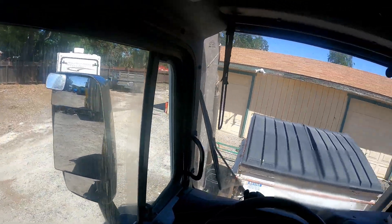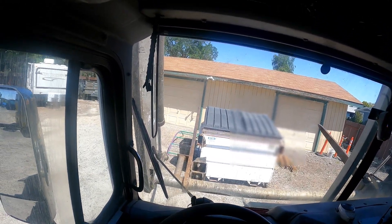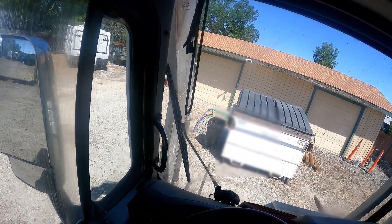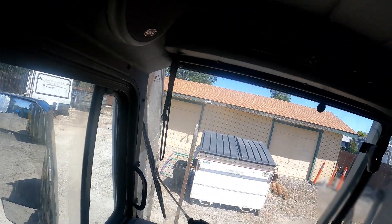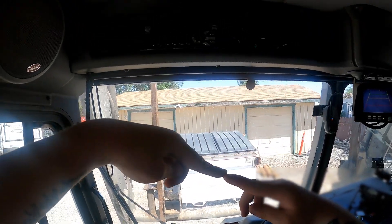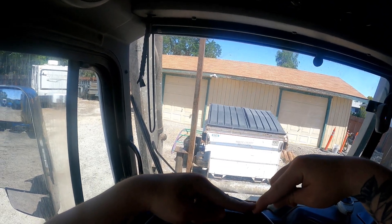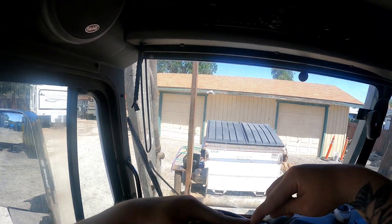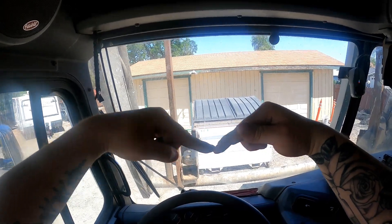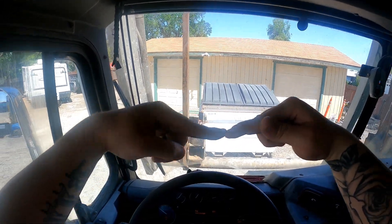Back up. If it was a yard and a half, like a one-yard container, you would actually pull out the forks a little more like that, and then lower the arms a little more. I adjust the forks based on how much adjustment I need. The lower the pockets — if the bin is lower — you actually will leave the forks more up and just tilt the arm down. But if the pockets are higher, you bring the forks down because the pockets are higher, the forks will be like this — meaning the fork will be too much, and it'll hit and push the bin away. So if the pockets are higher, the arms need to be higher, but the forks need to be lower to get into the container.